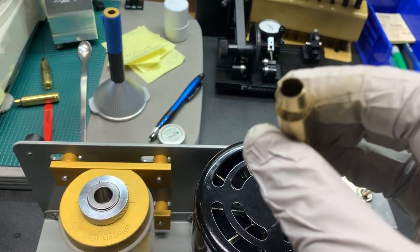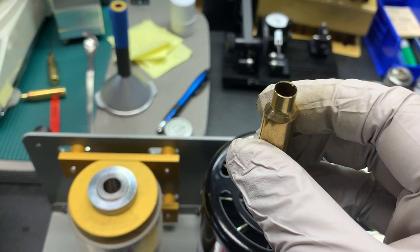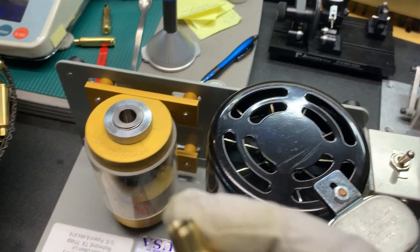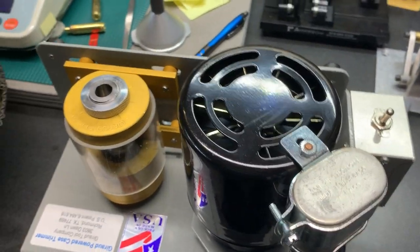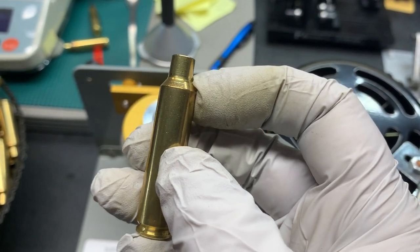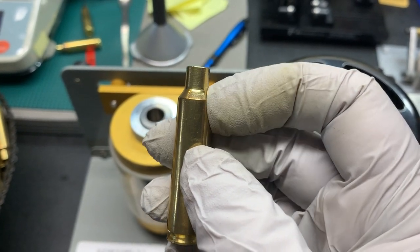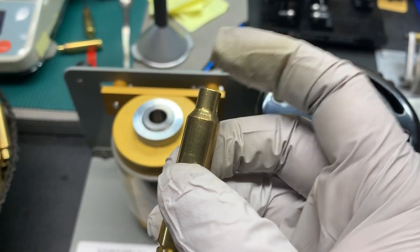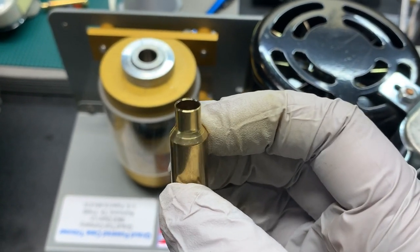Take a look at that — that's really the key of what this does. Look at the bevel on the outside, really nice bevel. It's accurate too — when I mic these out it's cutting within half a thousandth of each other every single time. His spring collet system is indexing off the shoulder, which I'm a really big fan of. Even though you're trimming to an overall length, I really like knowing that the shoulder is controlling the actual depth of cut. I feel like it just comes out more accurate that way — and that was something I really liked about the Lyman unit too.